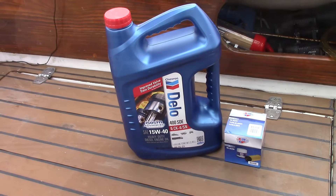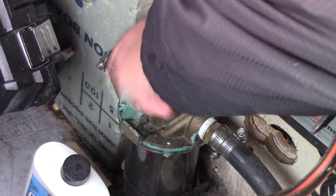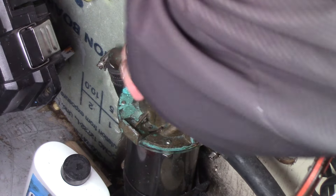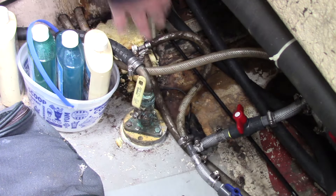I'm going to get ready to change the oil — that'll be coming up soon. I did all of these things before I even thought about starting the engine. Now I'm going down into the lazarette. First thing I do is take the cover off the sea strainer, make sure that's clean — that looked good, put that back on. Then open the seacock. Now I'm ready to start the boat.